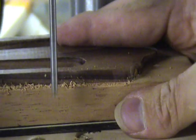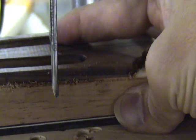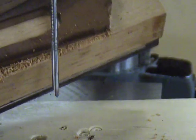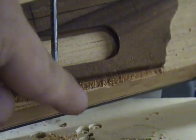Since you're cutting a trough, there's no place for the chips to be ejected. These chips must be removed or the tool will not cut correctly — it will hang up as you try to move it along the template. The drill bit blank can also get very hot if you don't remove these chips.